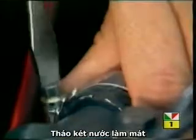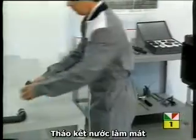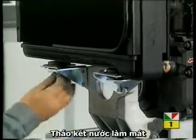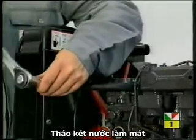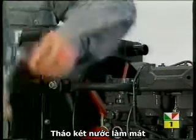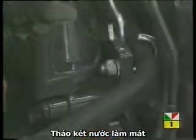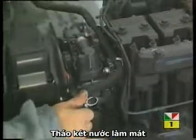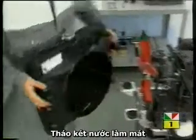from a water-cooled engine is the radiator. First, take off the hoses. Then take out the lower securing bolts and the securing bolts on the stay. Loosen the stay with 2 bolts on the water pump backplate. Then lift the stabilizing bar and remove the radiator.